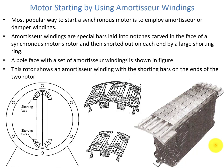In the previous video we have seen the two methods of how we can start the synchronous motor. One was to reduce the starting frequency and consequently reduce the voltage to avoid maximum currents that can flow into the motor. And the second method was to use some external small motor to rotate the rotor so that it can catch up with the rotating magnetic field of the stator.